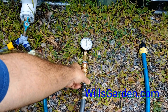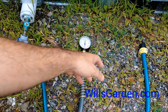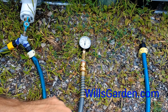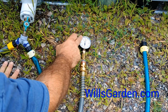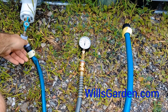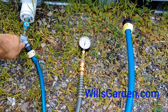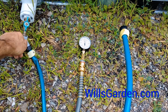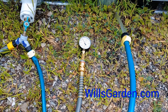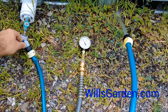We're getting roughly two and a half PSI off the double stack kit — high flow kit with a tank and a half of water. I just want you to see it's halfway between the two and the three. I'm going to go ahead and open up the valve and get the water flowing so you can see what the PSI is off the splitter. With it flowing, the gauge is showing just under two PSI — good flow, just not a lot of pressure.